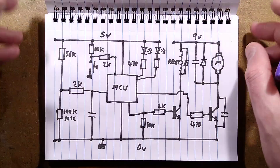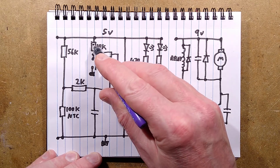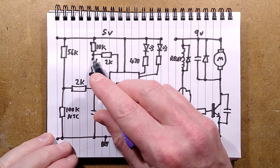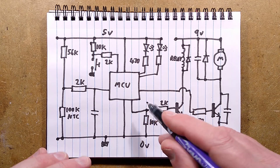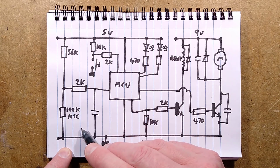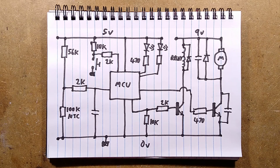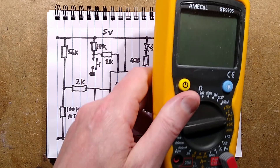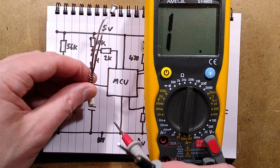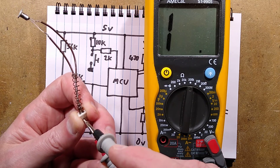The three supply rails — 9V, 5V, and 0V — go across to the microcontroller section. The 5V feeds the microcontroller directly. The button has a 10K pull-up resistor pulling that input via a 2K resistor up to 5V, but when you push the button it pulls it down to 0V. That button had bad contacts — but it's not the only thing. When I bridged out the button while powering the circuit from my bench power supply, it started flashing a red LED. It was detecting that the NTC thermistor also had a broken connection — it was corroded. I had to apply lots of aggressive flux to re-solder it onto those connections because they were corroded and it had soaked up inside the cable.